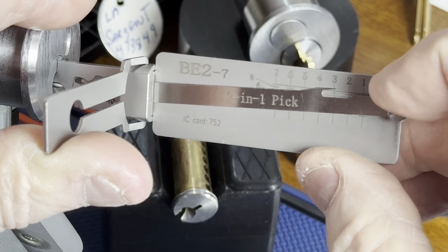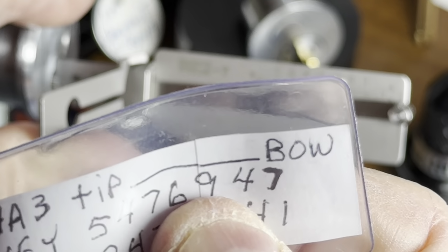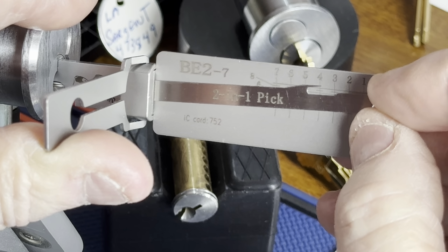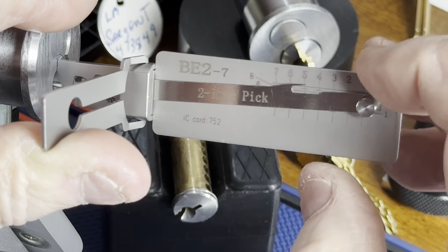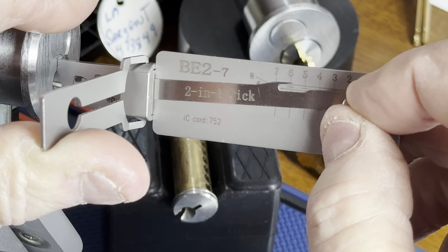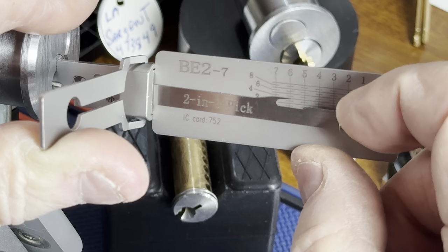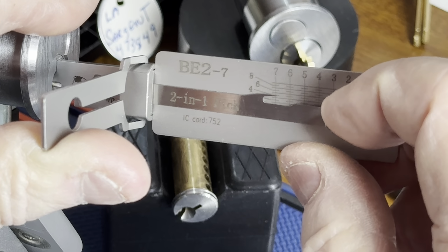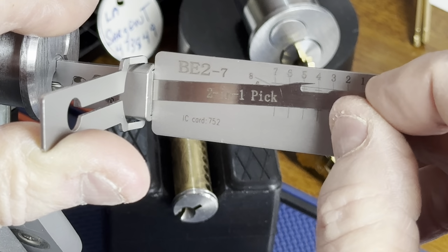Great click on two. Good click on three. Now remember, the three is the nine cut, so it's way up there. That can fool you. That's a troublesome thing. When there's a nine cut in there, you've got real problems. All right, now four is a great click. I love the sound of them popping. Oh, good solid click. Nothing has run back up into the chambers because I've got so much tension here. Three clicks on six. That's really not good. I probably don't have enough tension there. And a good solid click on seven. And I probably overset six, but maybe not.